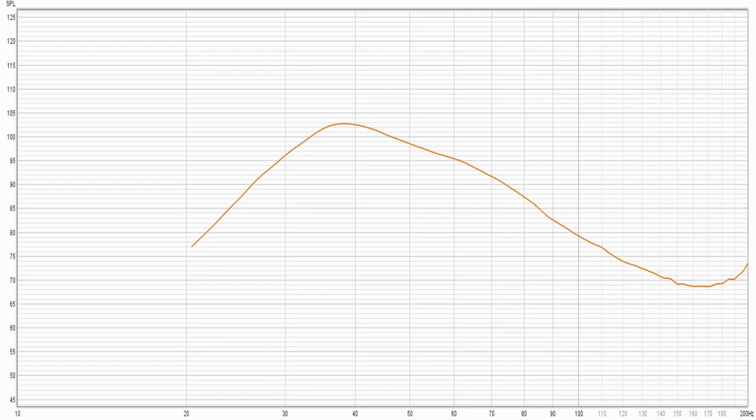If we look at the frequency response, we can see that it looks a bit peaky and it's not linear. This happens because of two things. First of all, it's probably because the box might need some tuning fiddling. But since this doesn't use a cylindrical port, nothing can be done at this stage. I'm not even going to check if that's true or not because it doesn't matter. Secondly, and most important, is that this amp has a low-pass filter and a subsonic filter. So the response is expected to have these early roll-offs, which will disrupt the linearity.